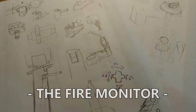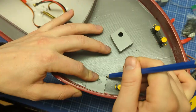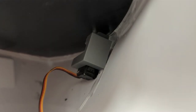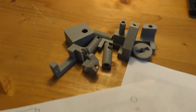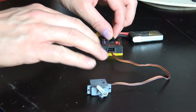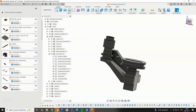I started by brainstorming some ideas because I wanted to integrate this 9-gram servo motor so it could rotate. Sadly, installing a servo directly underneath the deck where I wanted it didn't work because of the shape of the hull. I tried some other designs and it took me a couple of tries. Those little servos only rotate about 120 degrees, but that wasn't enough for me — my expectations kept raising as my failures accumulated.